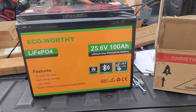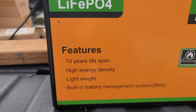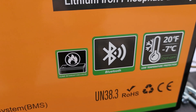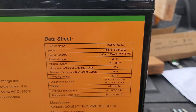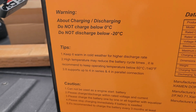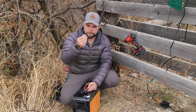T-Opens usually suggests taking two small 12-volt batteries and wiring them in series, but I wanted a reliable, powerful battery — which is why I went with the EcoWorthy 24-volt 100-amp-hour battery rated for 10 years. It has flame-retardant protection, Bluetooth connection, and low-temperature protection. At 2.56 kilowatt-hours, this battery could literally run the gate non-stop for 24 hours straight before dying. I'm not at all concerned about it running out of power.